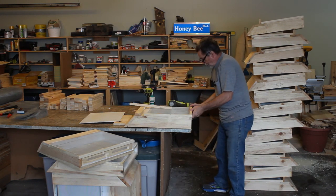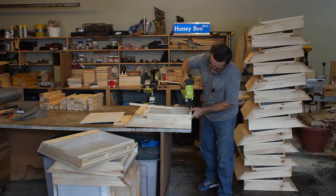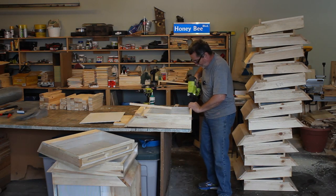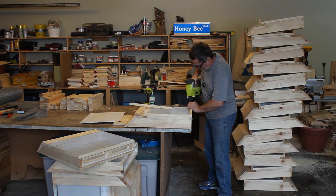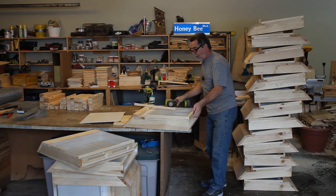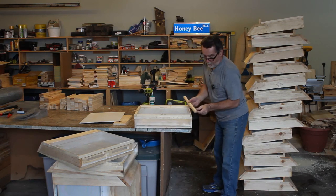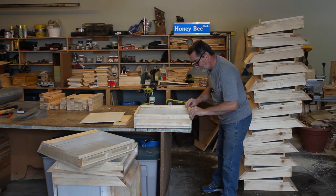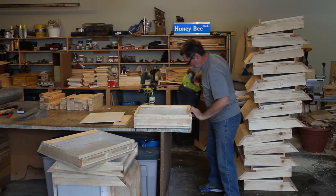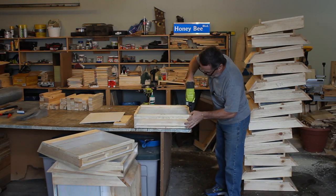I squish the screen down — sometimes you may have to clamp it, but very rarely. I throw a couple of air nails in each end first and one in the center of the back piece. Then I take the other 16-and-5/8 side piece, butt it up to the first, and throw a few nails in. This is the surface the brood box will actually sit on.